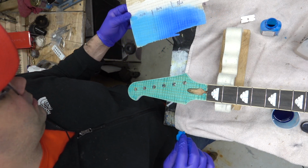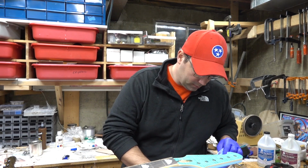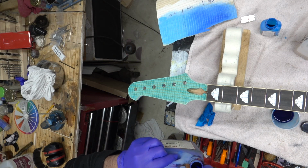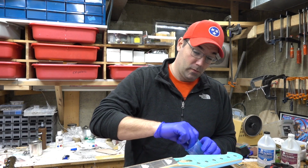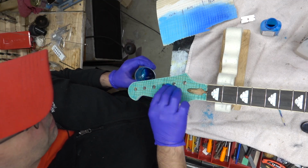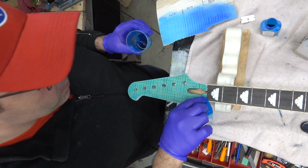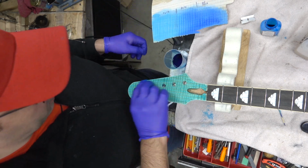As I'm looking at the color test, I think it needs like a drop of light blue. And I'm gonna do that like this. Going to take a toothpick and just mix in a little bit of blue. This will just add a slight tint to it. Needs just a little bit more. You see that little bit of blue made that huge difference. So now we've got like 3 coats. As we add that whitewash, it should mute this a little bit.